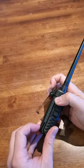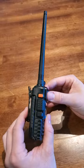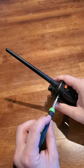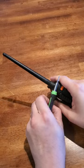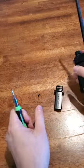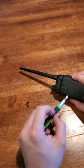One of the first things I like to remove is this big honking clip. I don't like it because when you stick it into pouches it tends to overlap, it gets in the way, and it overall makes the radio a little bit fatter and doesn't feel that comfy, especially inside a cummerbund in a plate carrier. So we're going to remove this clip — it's a simple Phillips screwdriver. You just unscrew that out, there's one screw, then the second. We're going to toss the clip, but save these two tiny little screws for later.